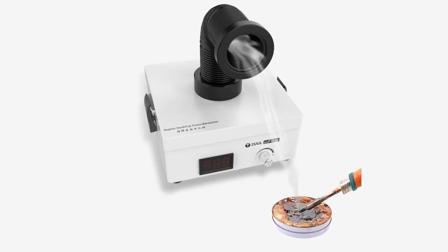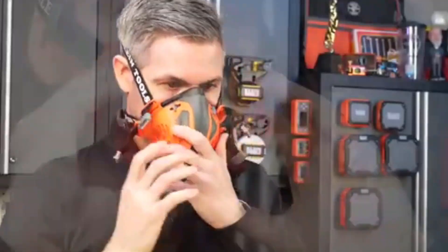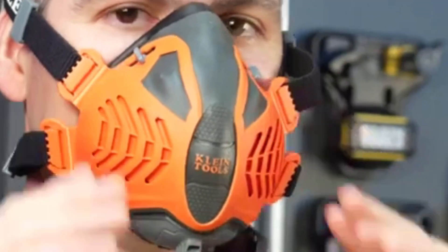So what can we do? Prevention. Set up a fume extractor and wear a mask — ideally P100, though it looks bulky. At minimum, consider an N95. You can Google or check with an AI to verify the facts on filtration effectiveness.